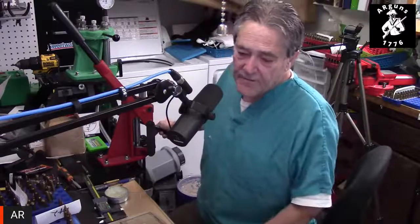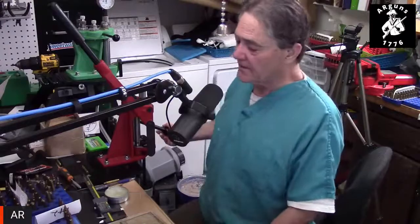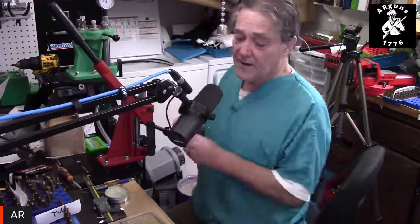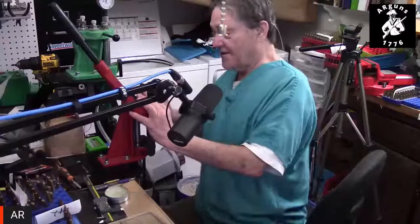This would fire in an AR-15 with one thou over. I don't really want to go to SAAMI minimum because then you're really oversizing the brass. So we'll call that contact. We'll call that good. Close enough, as they say, in reloading.